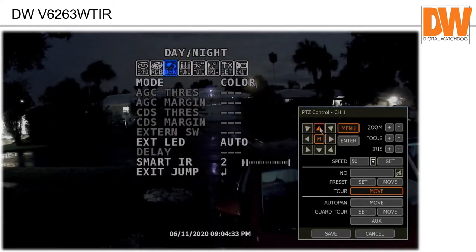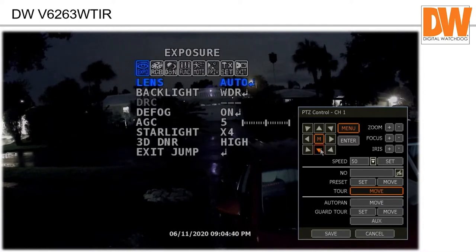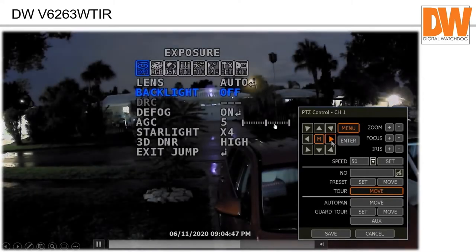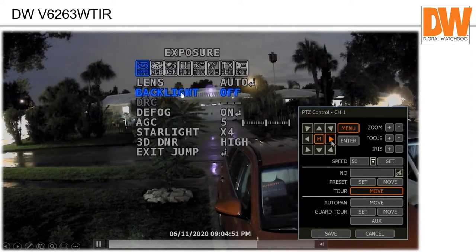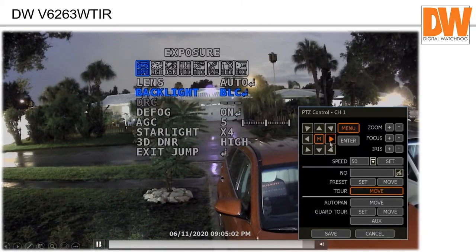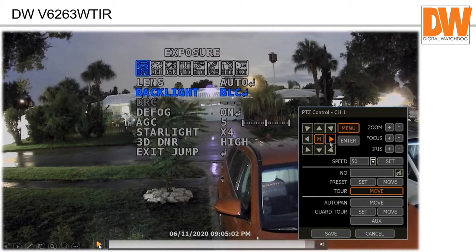When the IRs are turned on they can pop up. You can add more color gain to the scene or increase AGC, which increases the sensitivity of the sensor to light. Wide dynamic range and starlight don't mix, so leave WDR off when using starlight. HME — Highlight Masking Enhancement — is designed for really bright lights such as getting a view inside a car or reading license plates in black and white mode. It electronically blocks the brightest light and boosts the darker areas.